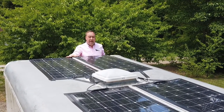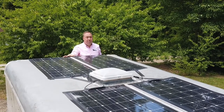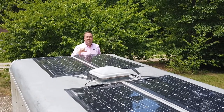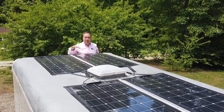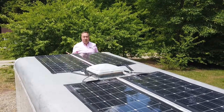These are four panels that are 100 watts apiece. It's an 18-volt system. It's hooked up to a DC to AC inverter, which I'll show you in just a minute, and then that plugs into an outlet on the house, and that outlet then back-feeds the grid. I'm putting 400 watts of power anytime the sun is out back into the grid.